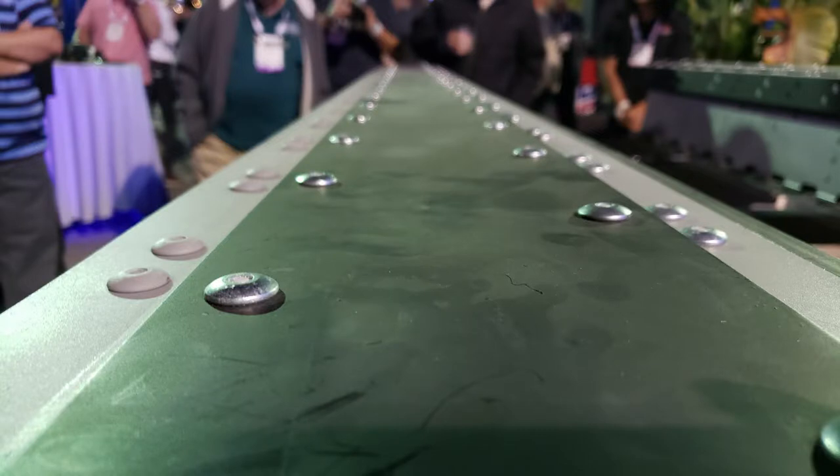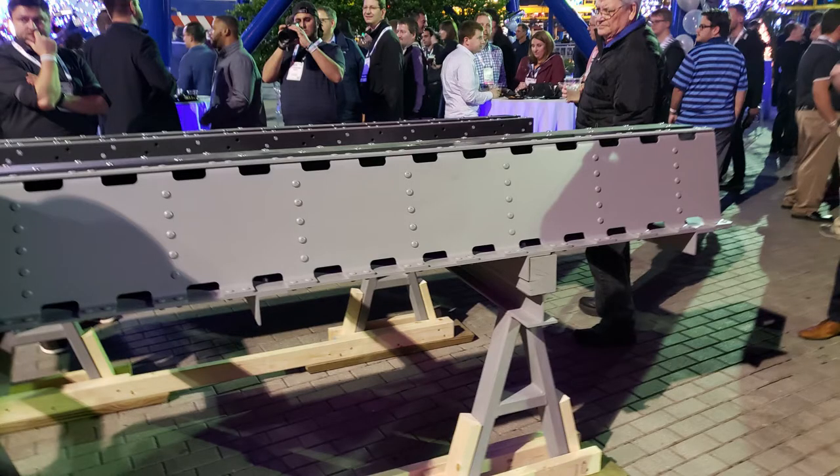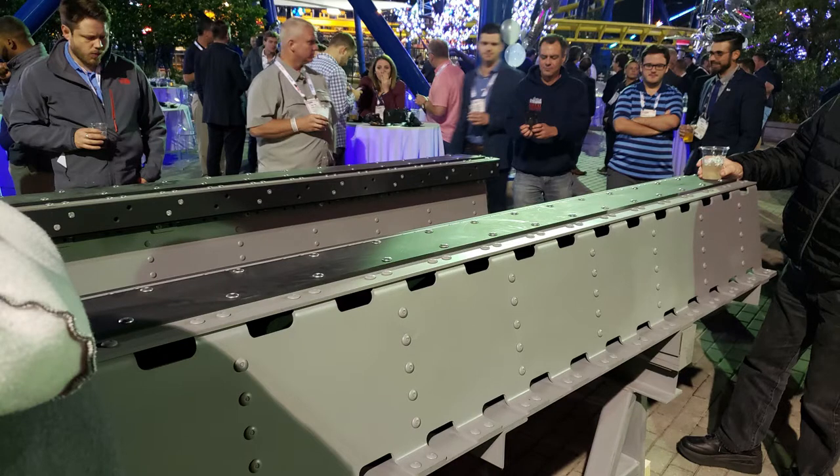The main beam has four sides — the outside and inside faces are slanted, so the cross section is a trapezoidal shape, which you can tell if you look at it from the end. The guide steel and upstop steel are attached via a bracket, which also facilitates replacement in case the guide or upstop steel needs to be replaced.